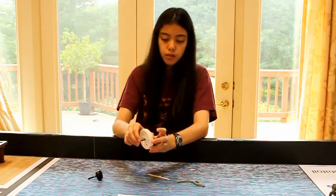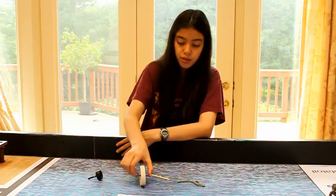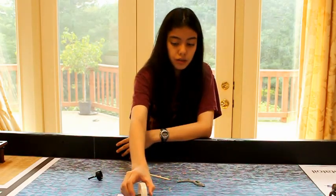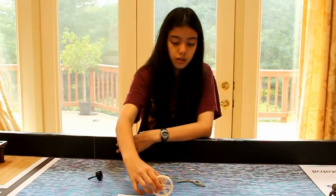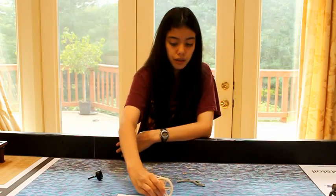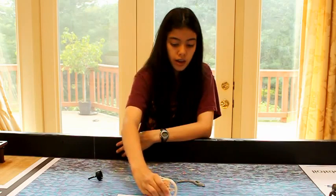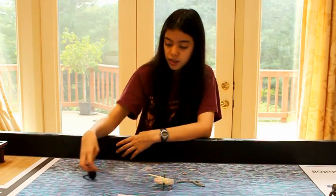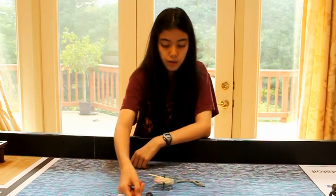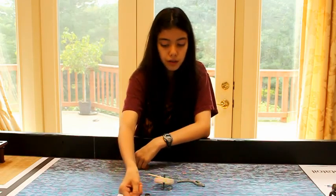Take this large plastic wheel — slide it in the direction of travel and notice that it slides very well. But if you turn it and slide it in the perpendicular direction, simulating a pivot, it doesn't slide very well. Notice that this small plastic wheel goes well in the direction of travel as well as perpendicular to the direction of travel.